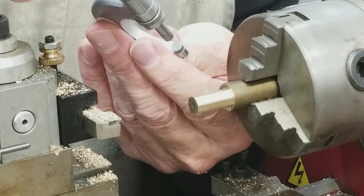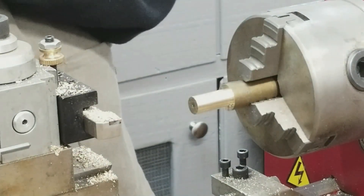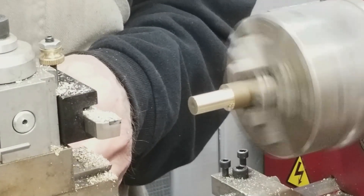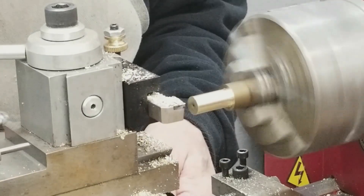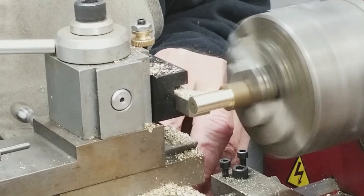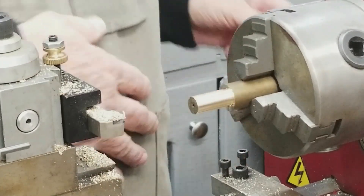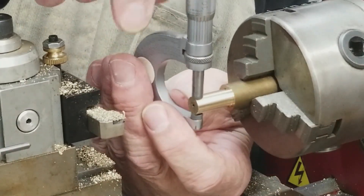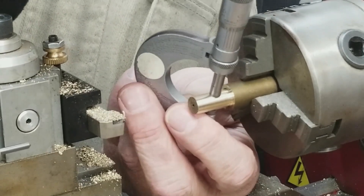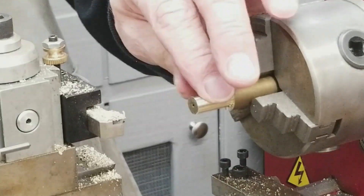Reading 378 — he wanted it oversized, so I need to take two thousandths off of that and call it good. That should be it. 376 — it's about 376 and a half, but I'm going to call that good.